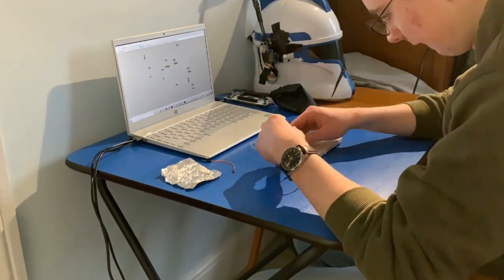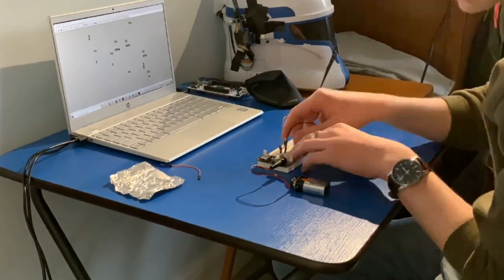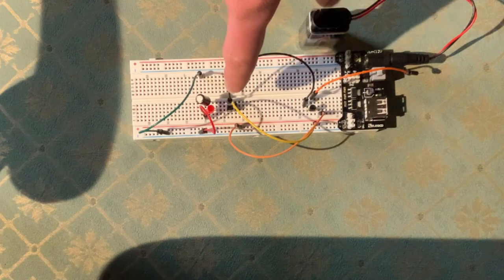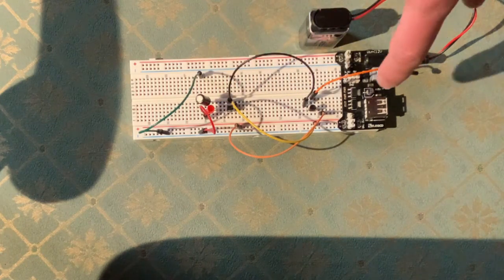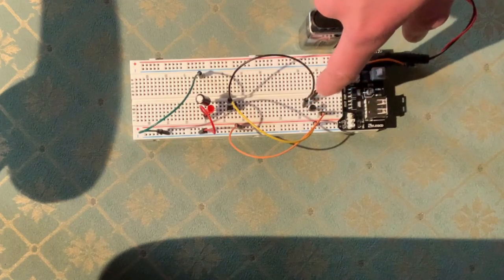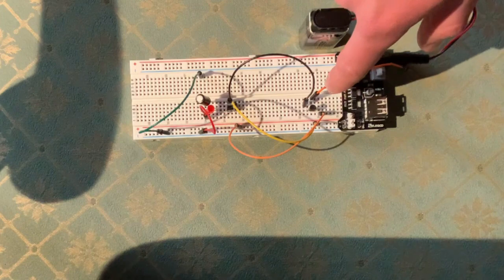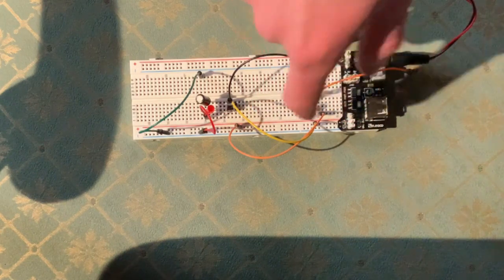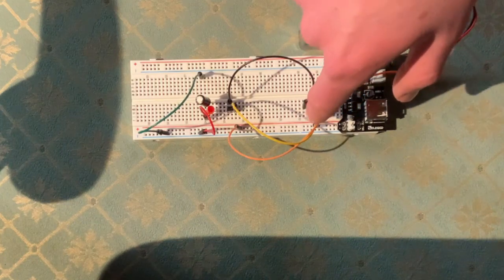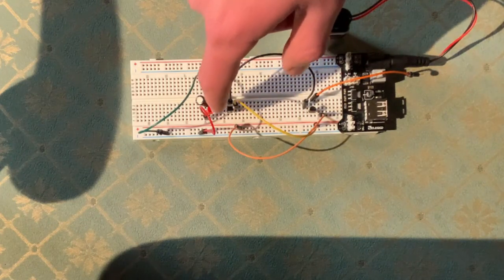Time to make it real. So here are the two BJTs — bipolar junction transistors. Essentially they have three terminals: a collector, emitter, and base. When a current is applied to the base, a larger current proportional to the base current is driven between the collector and the emitter. Essentially, if I apply a current here more current will flow through this transistor, and because I've hooked this up to a second transistor this will amplify it further, allowing me to turn this LED on.